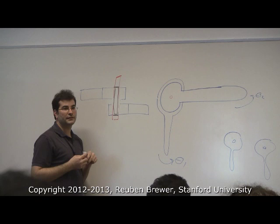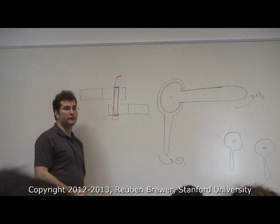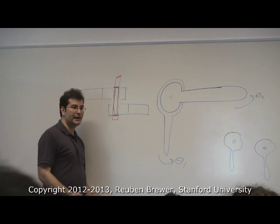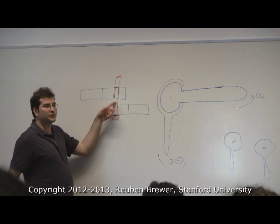Okay? Now the other thing is, I've seen some people have robots that have to be assembled in a strict order of operations, but it's crazy order of operations where if one screw comes loose on something, they have to take apart the entire robot to tighten that screw. Sometimes you have to, but that is so painful. Believe me, I have lots of those in my dissertation robot just because it's unavoidable, but try to avoid it at all costs. So let's think about this. Say, for the sake of argument, that I'm wrong and this works great and you can use a spacer and preload it and everyone's happy. Okay?